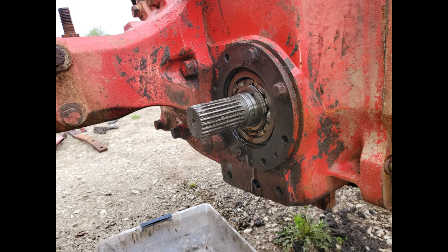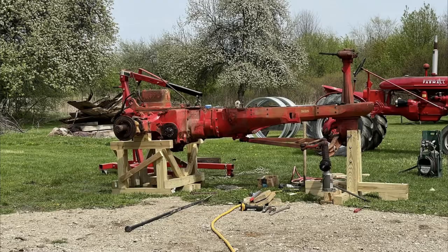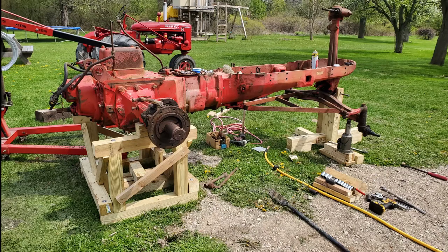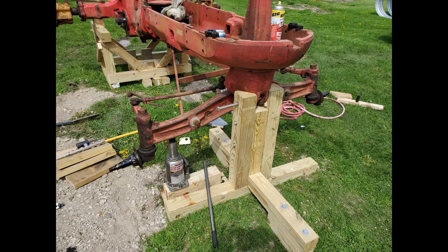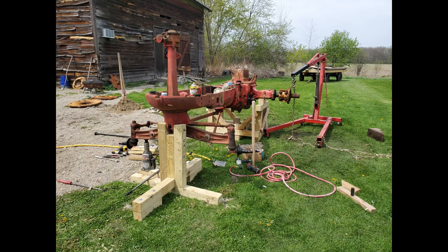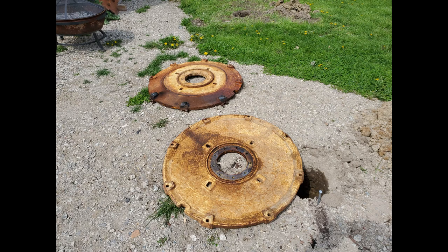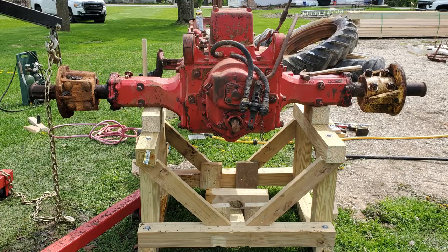With the frame on the crib, the rear tire and rim assemblies were removed with support from an engine hoist and came off with a breaker bar. These were trash and would be replaced. The axle fluid was drained and the brake housings were removed since they would need new seals. The front wheels came off last and these were some seriously heavy two-piece castings. The rear hubs are large iron castings as well and they came off with the hoist.